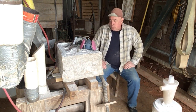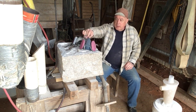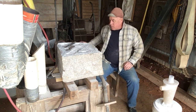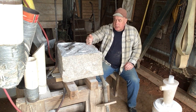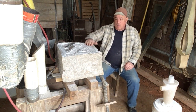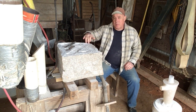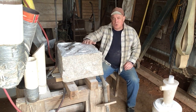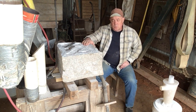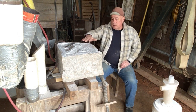All right, back to the stone. I'm going to get to work on this stone and work this panel down. It's important to understand that we're not as concerned with producing a level panel as we are with producing a flat panel. So I'm going to work this down in between these. I'm going to keep measuring with my plumb blocks and my straight edge, and I'll cut in and out and show you some video on it, but you may have a belly full of just watching me run a hand machine. But I'll get more on here and capture this video.